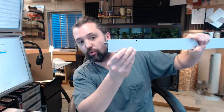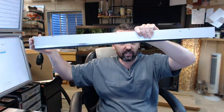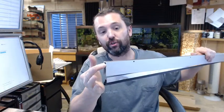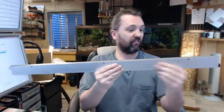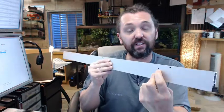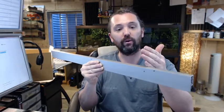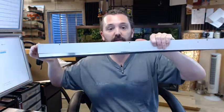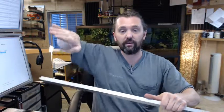I have got this turned out several revolutions — as I push this you can see it drops down a lot further. You would never cut the plunger side, which is the hinge side — you would only cut the lock side. How that happens is the plunger is connected to a flat spring. There is evidence of its mechanical attachment here — it is this little rolled pin holding it in. You are going to want to stay well away from that rolled pin in terms of your trim length. Plunger goes in, forces the flat spring to belly, and that bellying action pushes the entire mechanism down.